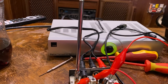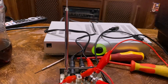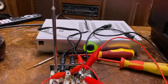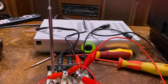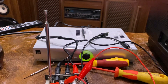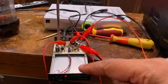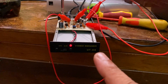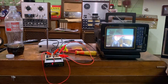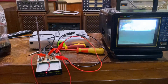This is a very old Dick Smith Electronics set-top box. It's actually got digital — you can pick up digital TV — but it's got an antenna out and a built-in modulator. So if I connect the TV with an analog input it'll work. But what I've done is take the audio-video out of the set-top box, put it into this little UT66 sender, and it's sending the signal with pretty good range. I can walk all around the house with that thing and it works. So that's pretty cool.